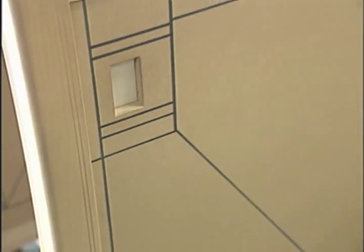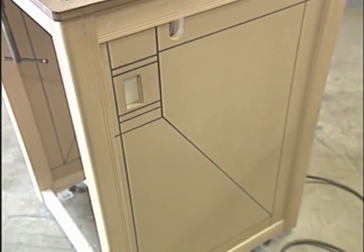The box is hardwired. A simple wire winder underneath keeps the cord neat. The motor and vacuum plug into a double socket on the inside, and it's controlled by a single switch buried in the mortise of the exterior. It's pretty handy and buried deep enough so you can't accidentally bump it on. It's a lot safer than groping for a switch under the table.